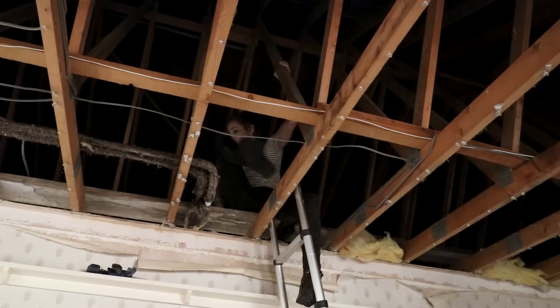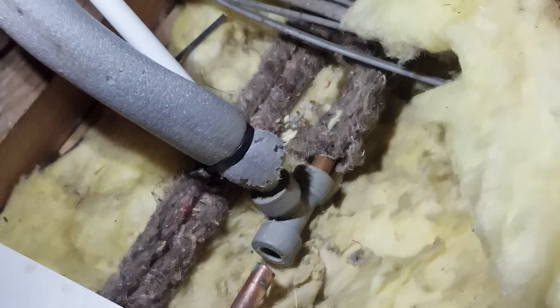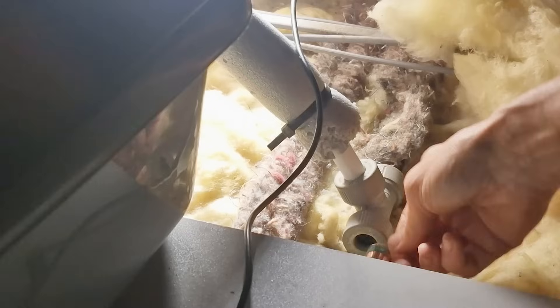I've got my plumbing bag and I'm climbing up into the attic to see what I'm dealing with on the other side. It has come out — I definitely don't have this part, it's a three-way fitting. It's a few hours later now because I had to go back to Tool Station to buy more speed-fit fittings. After speaking to my dad, he suggested that if pipes freeze it could affect all the other joins, so I need to have a look, do some chopping and reconnecting. There's an old HEP20 T-connector up there — I can't unscrew one end.